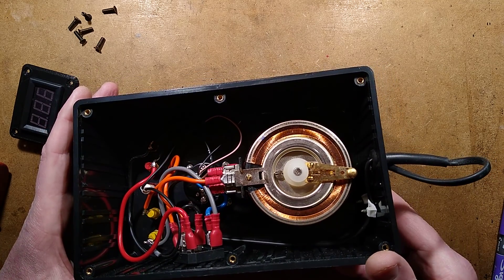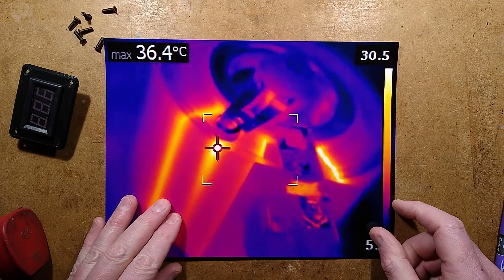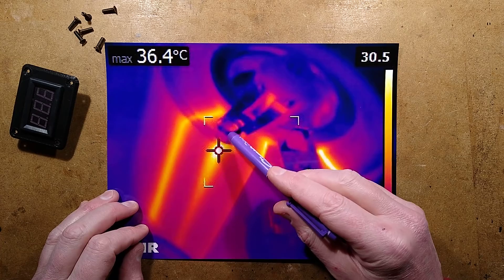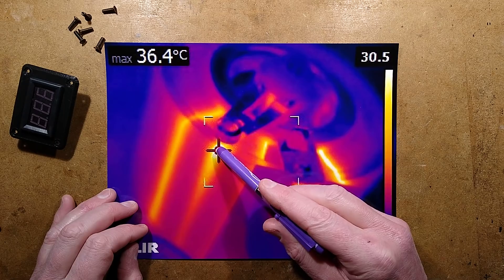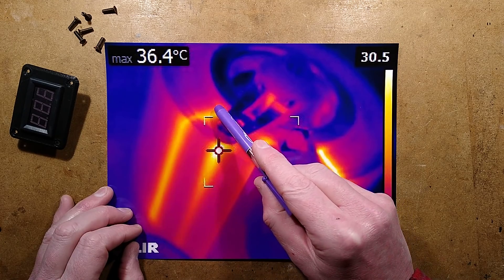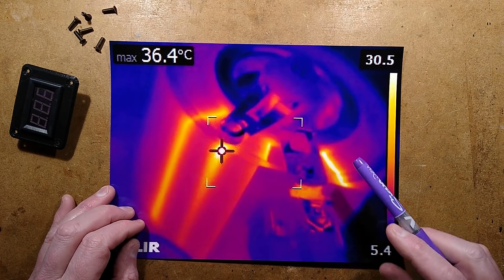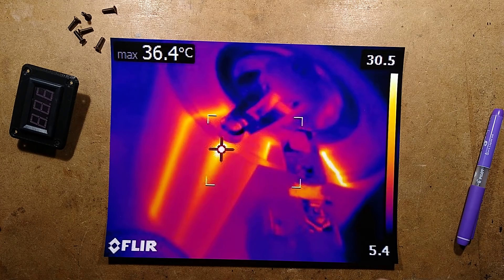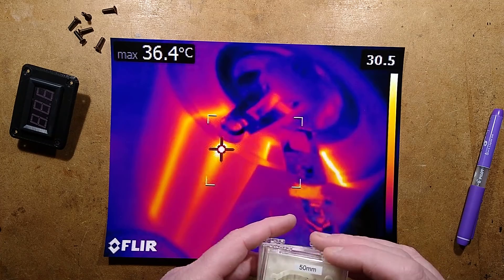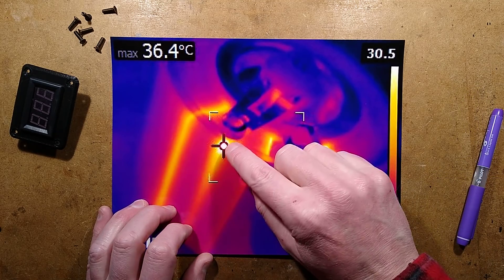The thermal image has shown a lot, so I'm going to bring that in now. The thermal image shows where the brush has made contact — the windings are heating at that point, so they are bridging out and there are basic shorted turns, but the current isn't that much. It also showed that there is already an inherent shorted turn here, and I wondered why those ones were shorted as well at the end, giving a definite heat signature. I used the FLIR with Christophe's lenses — the 50mm and the 101mm — to get up close to this, which is why it's a fairly high resolution image. They work really well, those lenses.